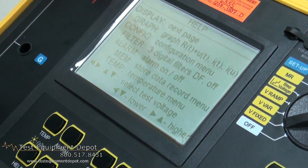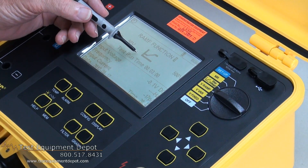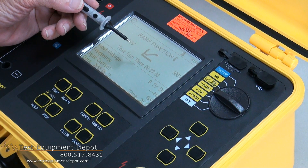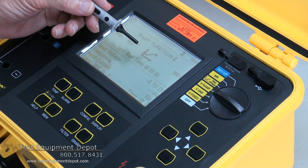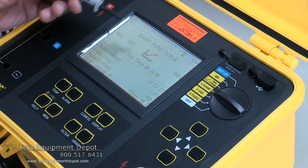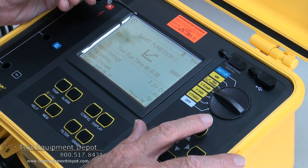Again, showing the input voltage, frequency, and so on. In the V Ramp position, I can determine a lift-off voltage, set the ramp time and the ultimate hold voltage, and determine how long it takes to get there — so we can apply a voltage over a period of time rising up to a predetermined high-level point. I have three of these functions I can store here automatically: Ramp 1, Ramp 2, and Ramp 3, each with different voltages pre-programmed to go up to the top of the ramp.